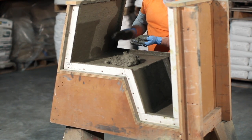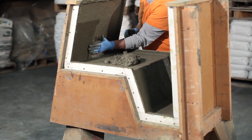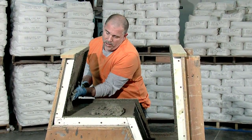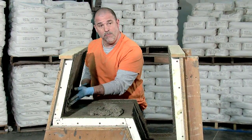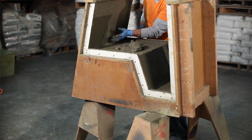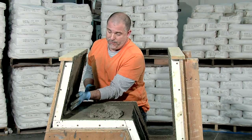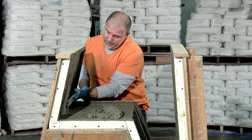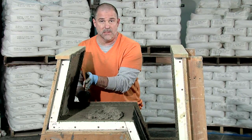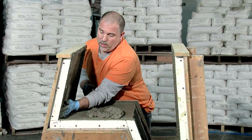When I first start off, I want to start on one of these vertical sections. Just taking a handful, kind of lightly pressing it into the form in a smearing action. I don't want to press too hard or I'll press the back material through the face material. And I don't want it to be too thick or I run the risk of peeling the face material off the form. So I'm adding here maybe about an eighth to three sixteenths of an inch layer. Remember, we're going to be building this up to one inch thick, but this first layer that I apply is going to be probably the thinnest one that I set.